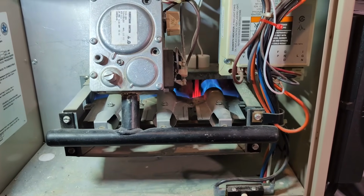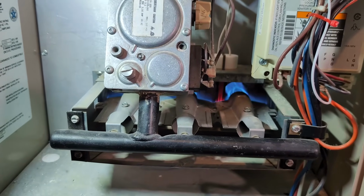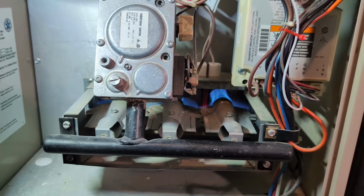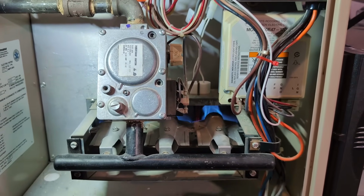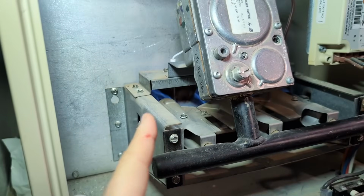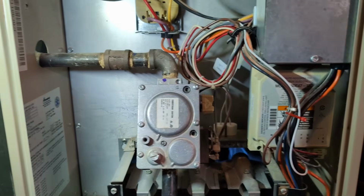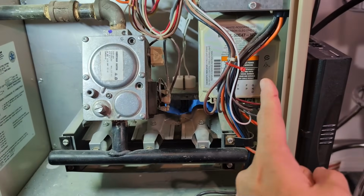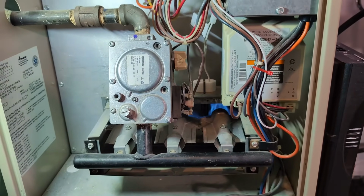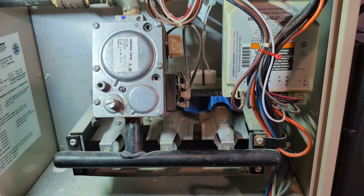Nice. Awesome that I had the spare part that I needed. Very, very exciting. Very, very cool. So this will run a little while with the heat running. The thermopile there, that white wire that's in the flame sensor, detects that there is flame. The control unit is happy. It will turn on the blower, which will give heat to the rest of the house.